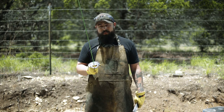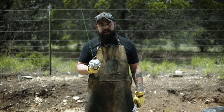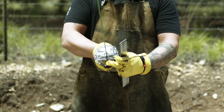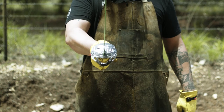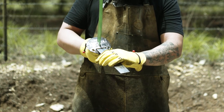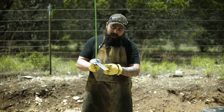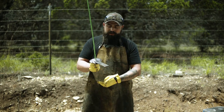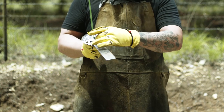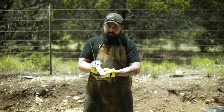What you just saw was me dishing out the top part of the hand guard and laying in all the principal artwork and engraving. The skull's mouth is intentionally open — we're going to take another piece of steel, weld it into place, shape it for the knuckle guard, and get it all set. Once it cools down, I'll go in and do all the artwork down the knuckle guard.